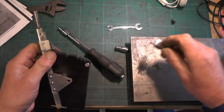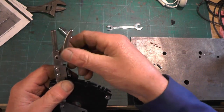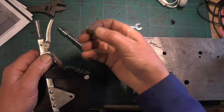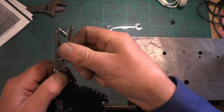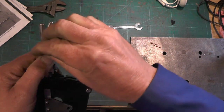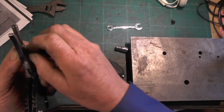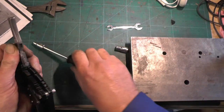Now we'll come to the latch lever and that's going to fit in this top pivot hole. I'm going to put another M3 screw in that. I've actually put a little bronze bush in there - it doesn't tell you to do that but I thought I would, with it being a pivot point. Then that's going to have a nut on the back of that, and eventually I'll Loctite these nuts on with a little washer behind.